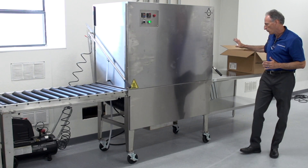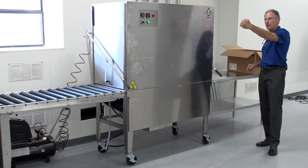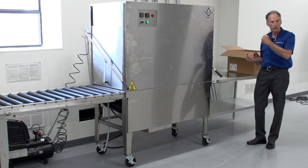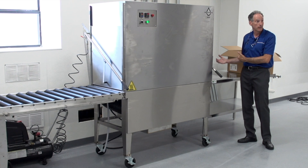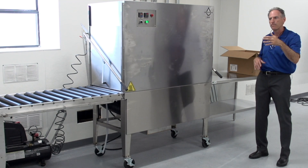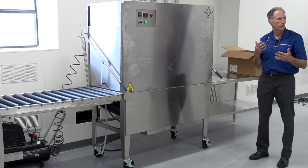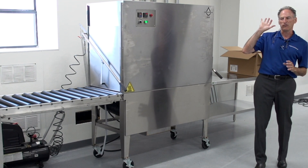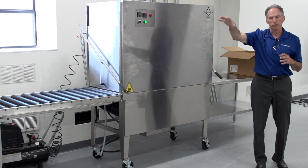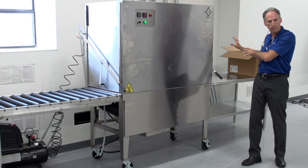The repacking is your bottleneck and that will set the speed for the whole system. I can't move anything more into the dryer — the dryer will handle three baskets of contents — and I can't push any more product through than the person packing can pack. That creates a nice flow of contents. The first few boxes that come through you've got people standing around, but once you've got maybe five or six boxes into the system, you've got a natural flow where the pre-wash is sitting with baskets for two to three to five minutes. The ultrasonic, as you've seen, is a much quicker process, but we can only go as fast as my person can repack.